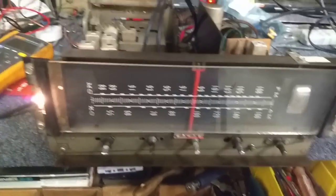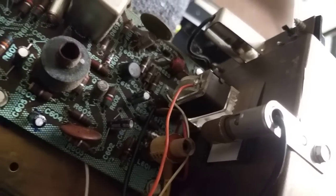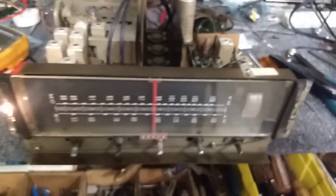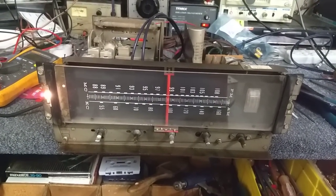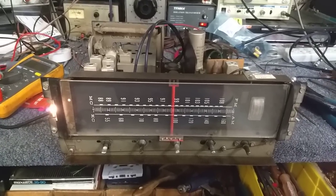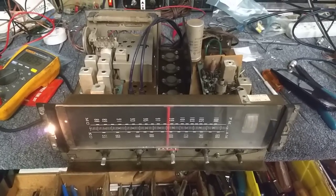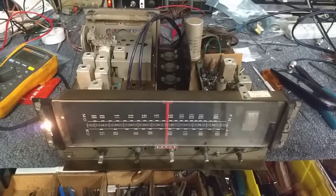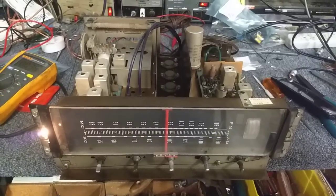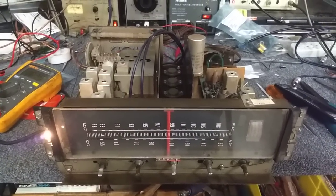As far as the lamps, number 1847 for the lamps — I haven't replaced these yet. The little meter lamp back here is a number 49, which is 2 to 2.5 volt, 50 milliampere. You could do an LED with this, although just get the lamp. That pretty much covers the basic service aspects of these self-contained Magnavoxes. That gives you a rundown on what to do after the recap. If you've got more serious issues, obviously you need troubleshooting. I hope this was useful to you guys with these Magnavox Astrosonics. You kind of do have to recap these before going crazy on them, but don't recap until you know that the basic aspects of the machine are functioning. Thanks for watching the video guys, more stuff to come soon. Bye.